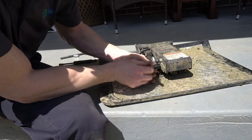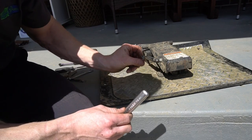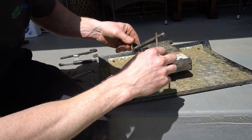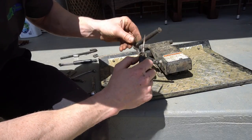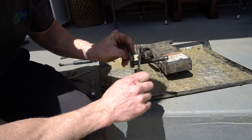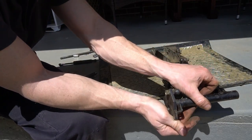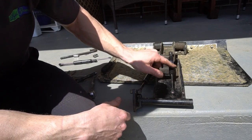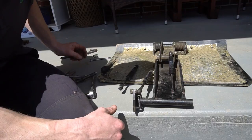You can certainly do this with a cordless drill to save some time, but pop that pin out right there. Then it's just a matter of grabbing it. Over time these will wear and you'll see obvious wear right here and right here, so this one is just fine but over several years this piece may eventually need to be replaced. Now we can come back in here — one thing to note: always note which direction your shock is facing so we need to put this one on like that, so I'll just leave that there for a reference.